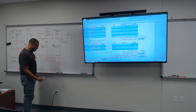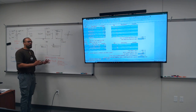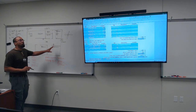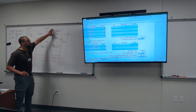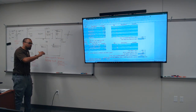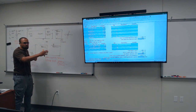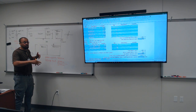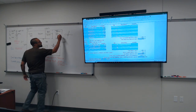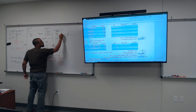I think it may be 12. It's in there, but I don't want to get stuck trying to find it on camera. But for the sake of this, we're gonna put one on each wall, okay? As long as you have one on each wall. But then again, when you do an actual inspection, the electrical inspector may say, hey, this is like 6 foot or 12 foot, you're gonna need another receptacle, because you don't want to go that far without having another receptacle. Nevertheless, it's in the NEC, but we'll get back to that next week.